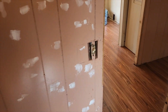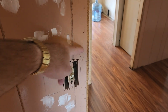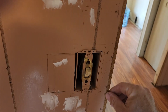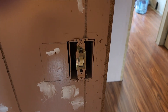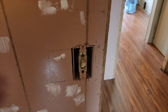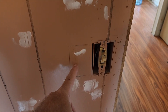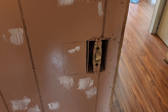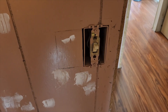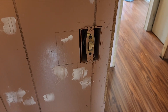I'm getting ready to work on some electrical. Look how close this switch is to the edge of the door. Originally this door just had a little piece of crown trim around it and that was fine, but we're putting a two and a half inch casing and that's too close. So I'm going to move this switch over here, plug that off, sand and patch it before we paint. We've already done some of the patching here, so let me go ahead and cut that hole.